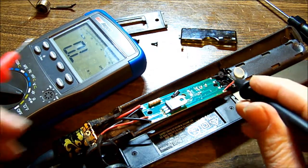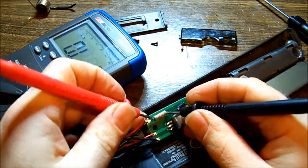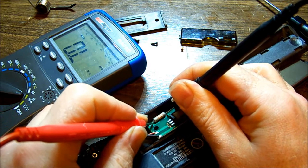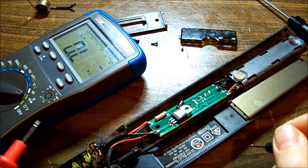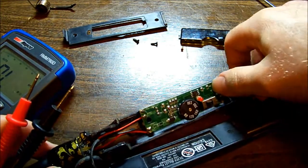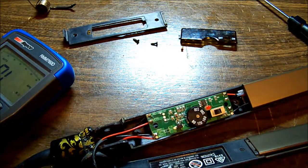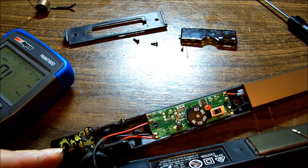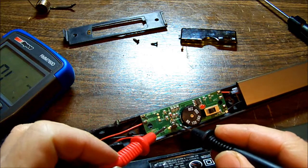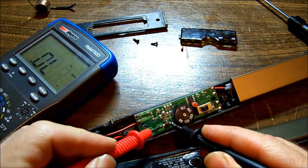So we've got the meter there, and this is red, red, red — which would be 2, 2, and 2 zeros, for 2.2K ohms. And right there you can see I'm getting absolutely no reading off that at all. Marvelous. So the first thing will be to replace that resistor. This unit is a year old, used daily — 365-odd days worth. I don't know what the average long-haired person would normally use their straightener for, but there we go. The diode on the top side is measuring alright.